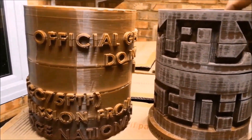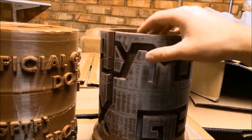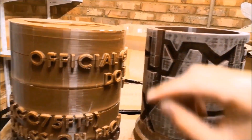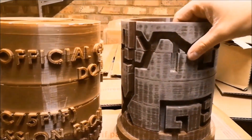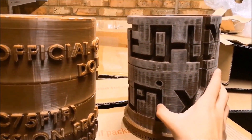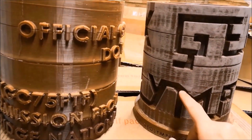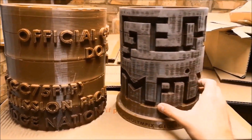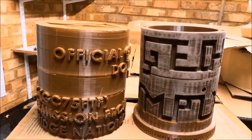During the sanding I realized I made a mistake. In this part of the puzzle it was too narrow for the peg to fit through. So what I had to do was get a rotary tool and sand that section down, along with the corresponding piece. I used the rotary tool to make it large enough so that both pegs could fit through. Now that I've done that, it does work — this outer piece can slide through the maze and lock.